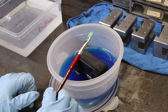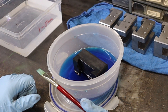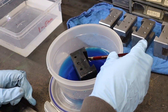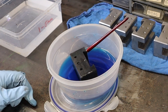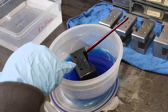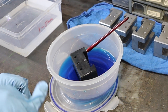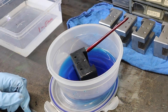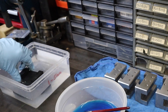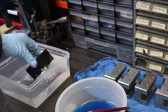Let's just leave that to soak a little bit — I reckon that's nearly time to remove. I'm pretty happy with that, that's quite a good coating overall. I think it's ready to come out. So I'm going to take this straight out of here, rinse it off in some water, then put it back down and give it a nice light coating of oil, and then that one is pretty much done. I believe the water basically neutralizes the chemical reaction between the acid and the metal.